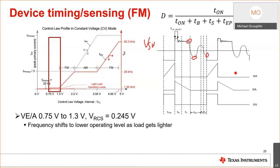And the other thing that an active clamp flyback does for you that this presentation doesn't even talk about, you're recovering the energy from the clamp capacitor, from your RCD clamp, and recycling it into the system rather than just dissipating power. An active clamp flyback is more efficient than a DCM flyback. This is a DCM flyback. So an ACF with zero voltage switching will be more efficient than this. But less than 65 watts, people don't usually want to pay extra money for an extra switch on the high side to form an active clamp.